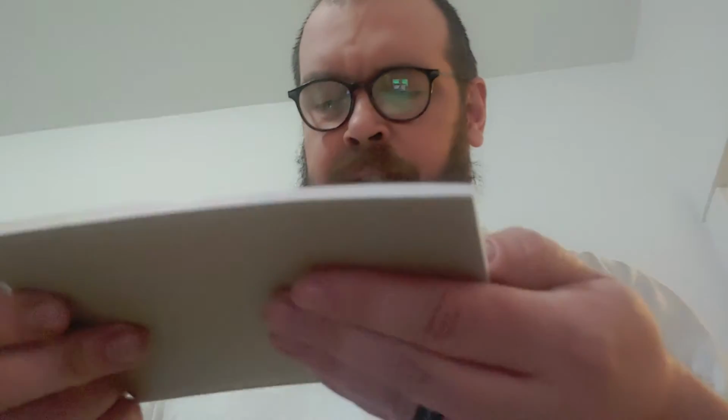Now, you want to get an even finer edge. You've already got it pretty well razor sharp, but you want to get it scalpel sharp. Here's another couple of tricks. Now for this, you don't want to color the blade, but find that approximate angle. Take a notepad, a nice flat notepad. Now I'm going to wipe the oil off my stone, and there's a reason for that.